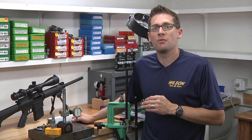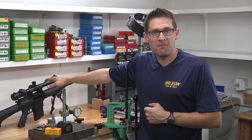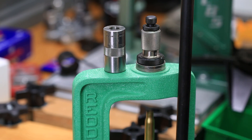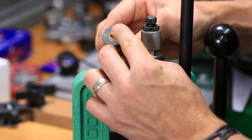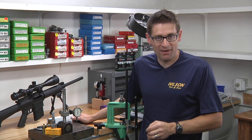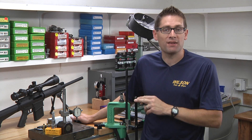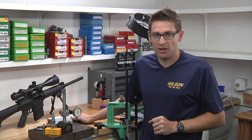Recently I had an issue where I had several different batches of reloaded .308 ammo that I had loaded for my LR-308B back here that would not chamber reliably in the field. I looked at all sorts of different issues, but a quick check with a case gauge revealed that the sizing die had not been set up properly. I had a sizing die set up that I thought was reliable and repeatable, but I hadn't checked it. I could have saved myself a lot of time, effort, and hassle had I used a case gauge from the get-go. That's why I wanted to talk about these case gauges — in fact, recently I've upgraded to LE Wilson case gauges for all of the cartridges that I load. It's that important.